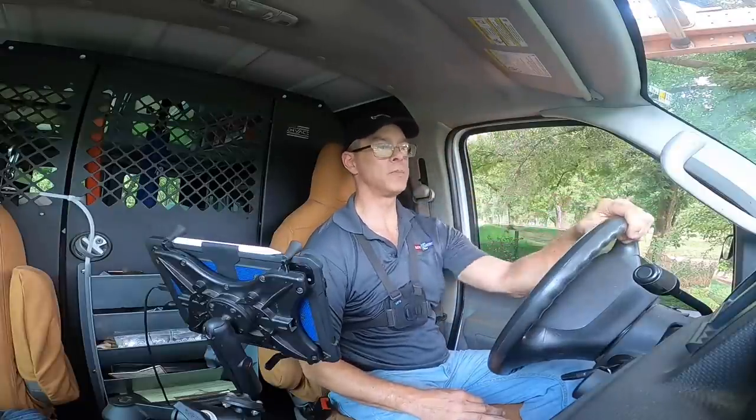All right, I thought I might explain a little bit because I didn't talk. It was with the condenser going in, my fan blowing on me. I know it's kind of loud. That thing lost most of its freon, so I went ahead and charged with 422B. It just turned into, instead of replacement, let's try to get it going and get it to last maybe another year or so.